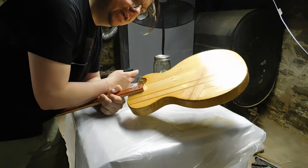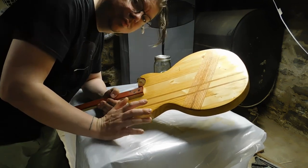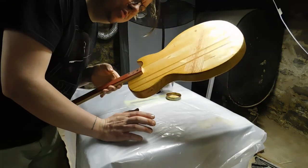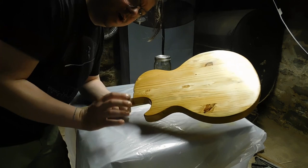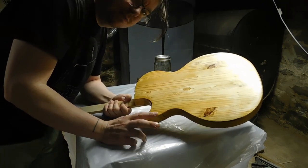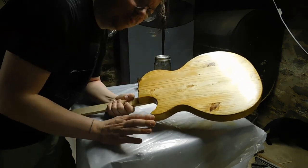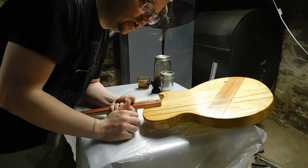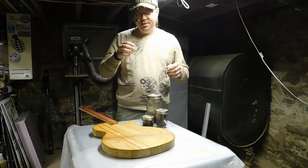I'm going to keep myself from making the same two mistakes I've made in the past. I'm going to stop right here and not overwork the surface — probably one more session with another three or four coats will get me where I want it, but I'm going to let this totally cure before I start that. The second mistake I'm going to avoid is leaving it in the shop overnight; I'll let it cure for about an hour and then bring it upstairs to the guitar rack.